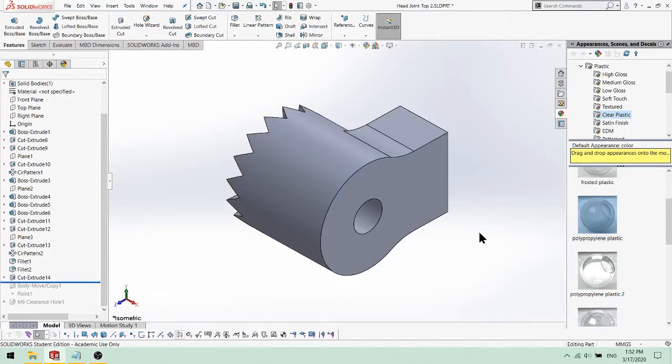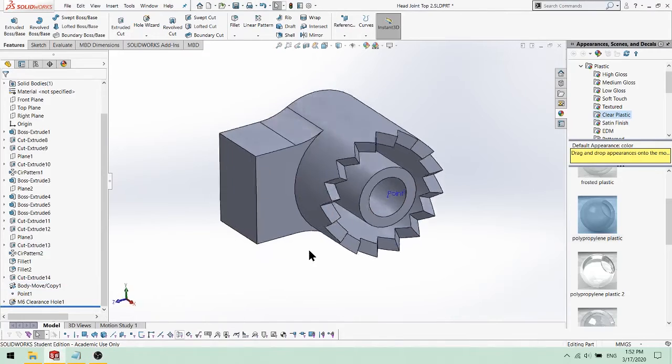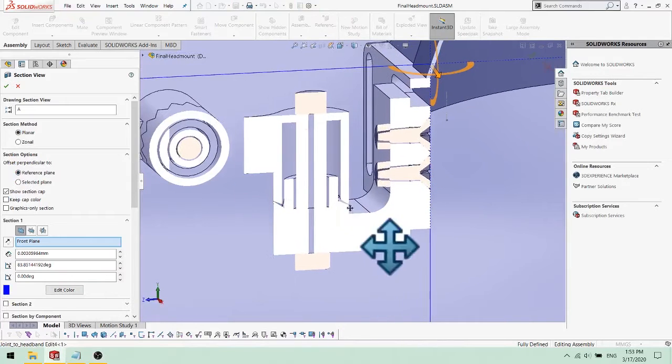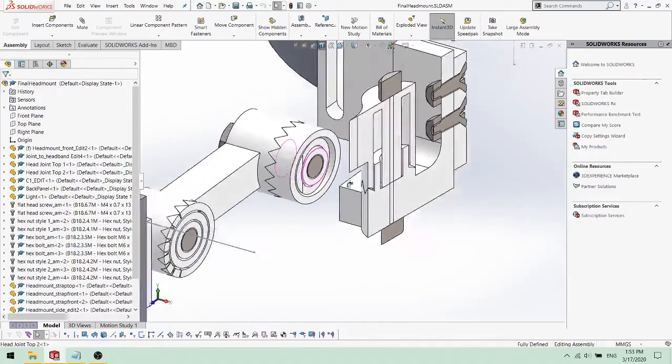One final thing we did was rotate the parts in their own files because the original orientations were hard to make engineering drawings for. Lastly, this assembly is not accurate to the real-life version because it does not contain springs. Our final product has compression springs loaded into any place held together by M6 bolts. However, this was not practical to model in SolidWorks, so we left it out.